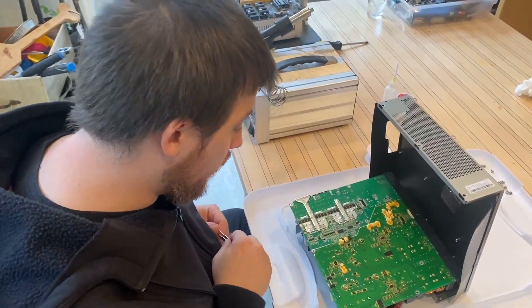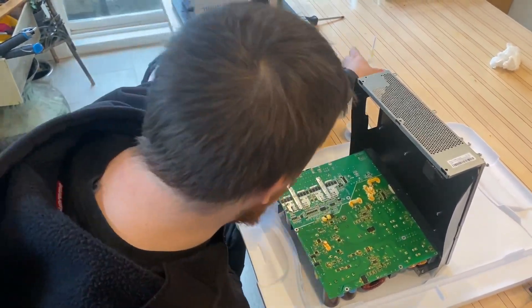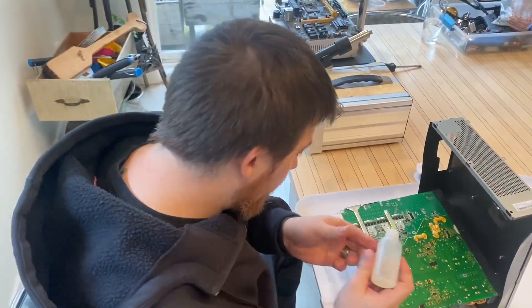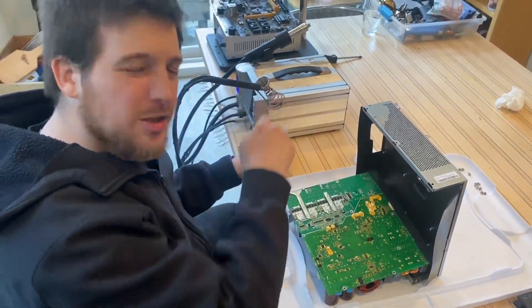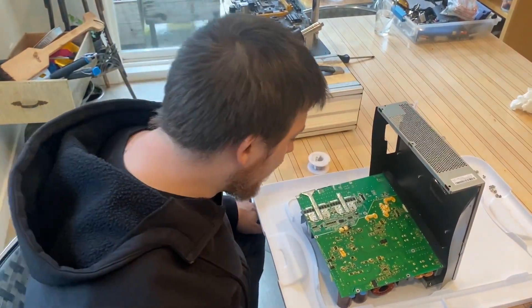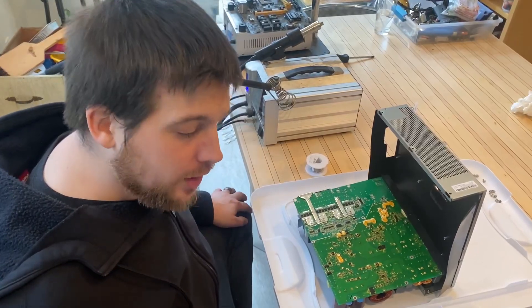So it's going to go around that previous resistor. We're going to put some flux on there. I'm a fan of liquid flux — Spencer has been using the paste. The liquid flux is kind of nice. A pro tip: a lot of people don't know this, but flux is really good at fixing oxidization and corrosion. So if you have an iPhone or a MacBook that's gotten some moisture on it, you can flux out that board, heat it up, and that will actually help those copper traces regenerate.